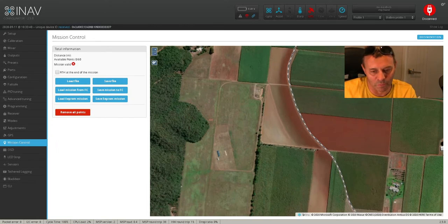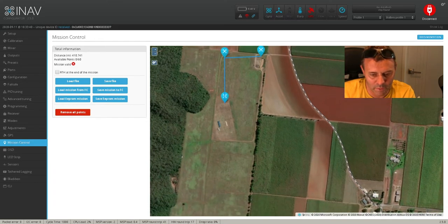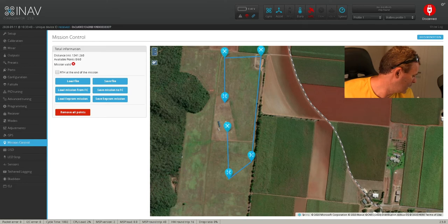Okay, so we'll create a small flight. What I want to do to start with — I'm going to be standing around here on my field. So I'll set a waypoint to start with. You just click and I've got a waypoint set. That'll automatically have an altitude of 5,000 centimetres or 50 metres, because that's what we set in the settings tab. I'll click another one down at the end of the airfield, then make another one come around here, and we'll click another waypoint there, come back to here, then back to home. What it'll do is fly in a circle above me here, which will be a 50 metre loiter radius.